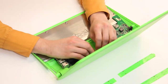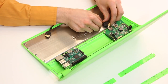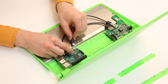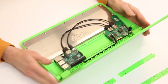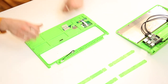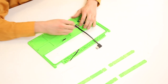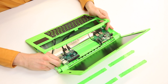Route the bundle of wires in the channel under the monitor. Connect the HDMI ports of the Raspberry Pi and hub using the supplied cable. Also connect the micro USB power port of the Raspberry Pi to the USB port on the hub. Plug the power control cable into the top port on the back side of the base top — the part with the keyboard. Plug the keyboard cable into the other port on the back side of the base top, and plug the other side of the keyboard cable into one of the USB slots on the Raspberry Pi.